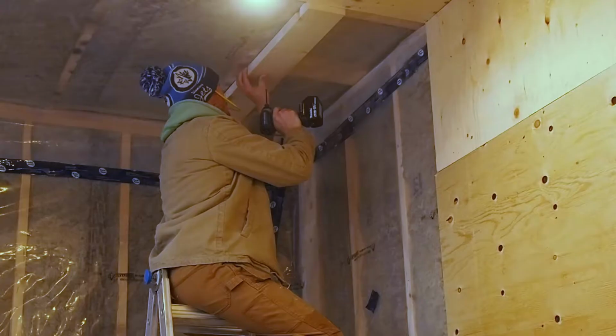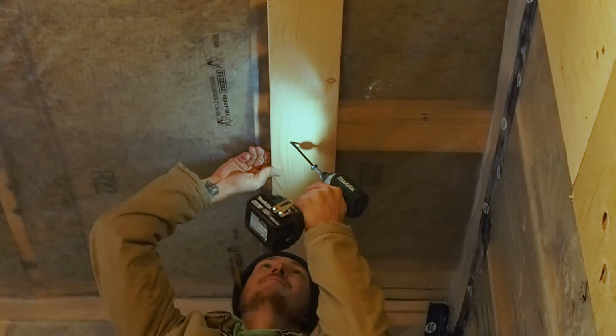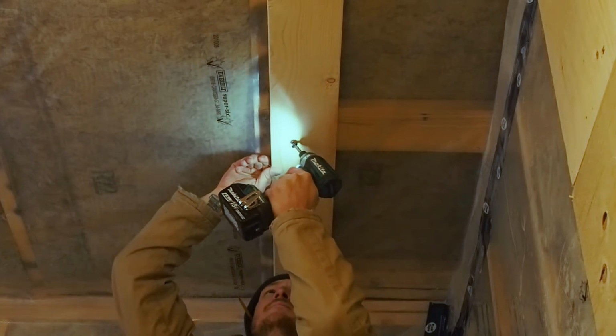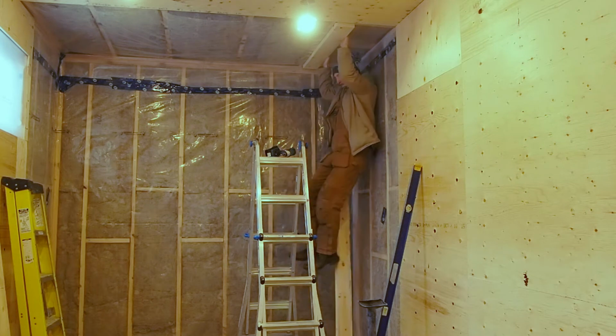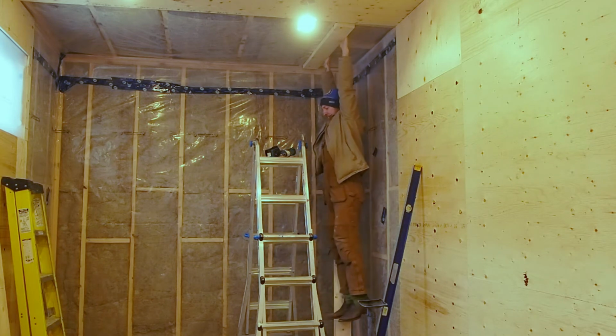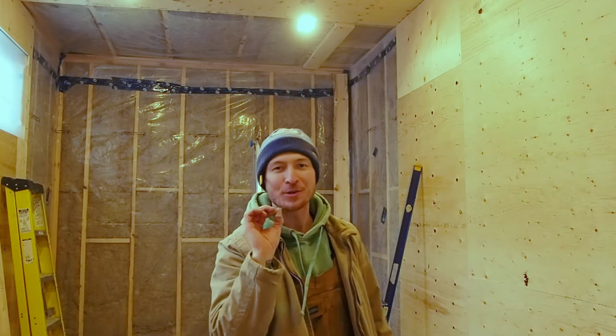The first step in this is to attach both my upper and lower supports on the wall and the ceiling. These are going to hold the joist hangers, which are eventually going to house the vertical framing members behind this angled wall. That should hold up just dandy.